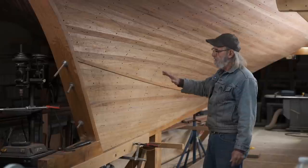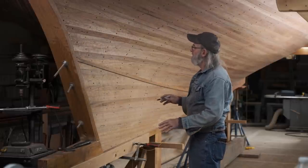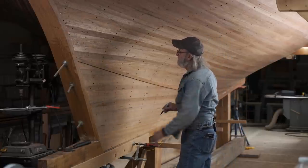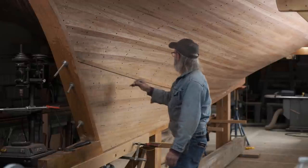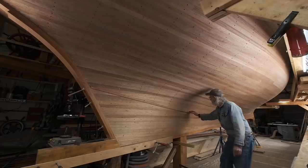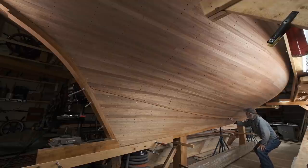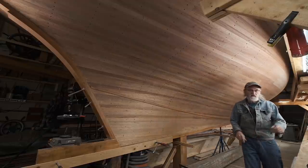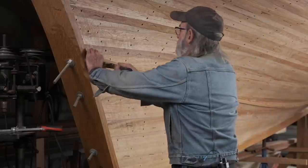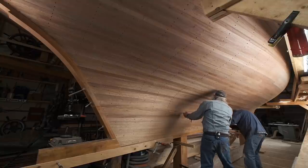So we're going to draw some of these lines in here. I'm actually going to take a magic marker and draw a little bit of magic marker dashes in it so you can see where the line is. I don't want to spoil where we're going to take our actual pattern right here, so I'm going to pick up close to that and put a line in there like that. I'm just going to dash some lines in here where I know it won't confuse us. That kind of gives you guys at home the idea of where that plank runs right down through there. From here forward, it's just a parallel five-inch plank. Now we're going to pull that batten — Ken and I are both going to pull it — and move it to the next five-inch line.